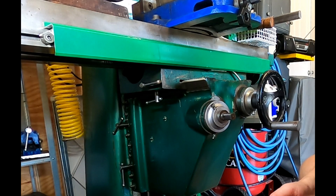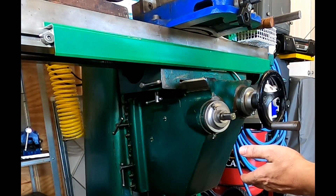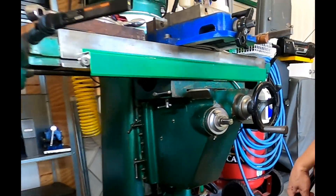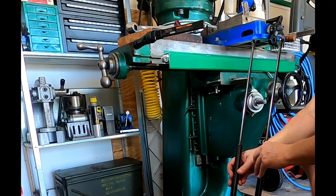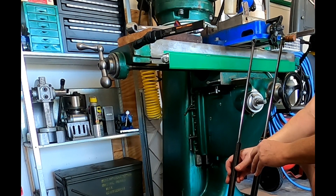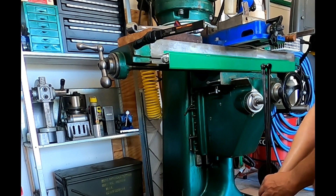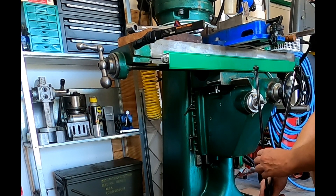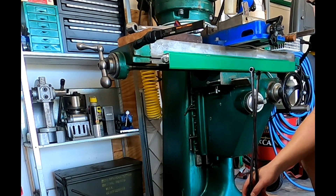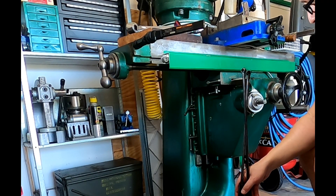I came to the conclusion I should get a little assistance. If you spend any time around machinery you may have seen that some newer equipment with stepper or servo motors uses a spring assist — specifically nitrogen-filled gas springs like these. You probably see them most commonly on a car hatchback or RV doors. Knowing that the table and knee come in at close to 400 pounds, I decided to get 200-pound assist springs — 200 pounds each — so we'll put these gas cylinders on and see what they do.